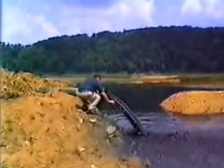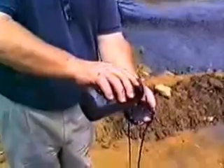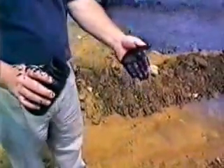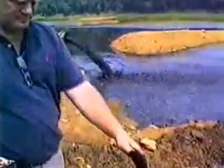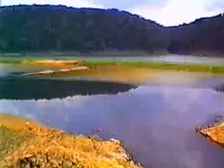At the other end of our discharge pipe we are taking a gravity sample. What we have is 32% solids and a 1.19 specific gravity slurry. It is a real thick milkshake-like slurry — when it is dropped onto the ground it barely flows, just a little bit.